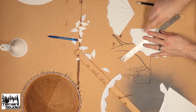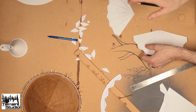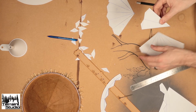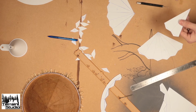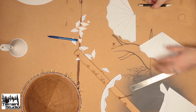So I'm going to show you. I just did that in two cuts, and you guys have seen three cuts. It was a little bit sticky. Four cuts, it kind of works. That's two cuts with a sharp blade, like butter. And so I use the four cuts almost as a safety net. Even with a dull blade, I'm going to get that through. But the sharper the blade, the fewer cuts that you're going to need. And it's really nice, crisp, and clean.